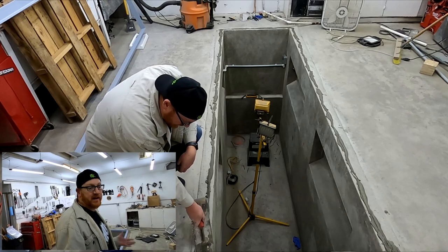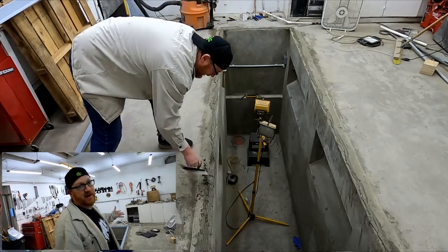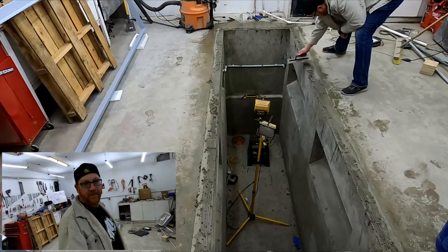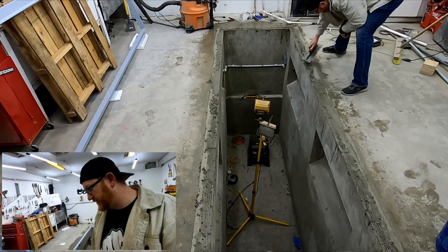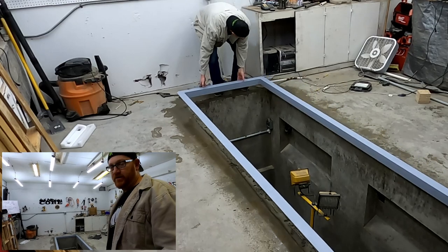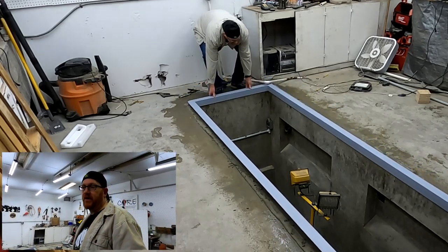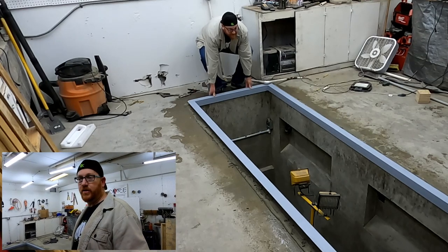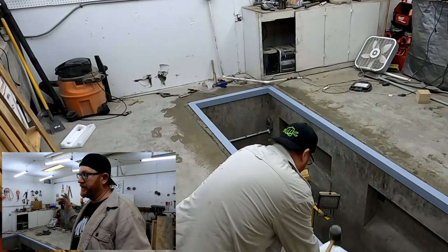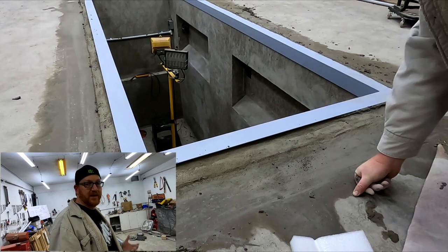Once again, frantic, mad rush, because you have to lay 30 feet all at once, and by the time you get back around, it's drying out. Not excited about this. This was not like just doing tile where you can keep everything close to you and just work it as you go. That stuff was setting up quick. Should have gone wetter. Should have pre-soaked everything. Definitely not enough depth on our mortar mix. Anyway, you live and you learn.